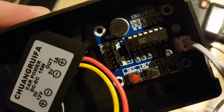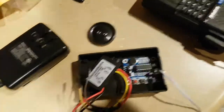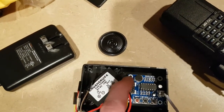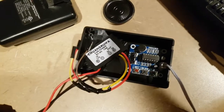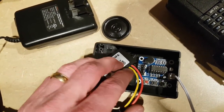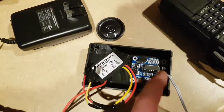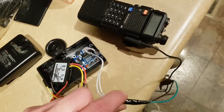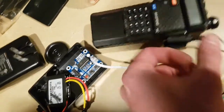How this board works: on the first pin it says VCC — that's where you apply your 5 volts power. The second pin down on the left is ground. For our purposes, all you'll need to know is the PE button, which is play edge, which means if you tap the button, it'll play whatever's recorded on the board. You can either actuate it by pressing the button or by sending positive voltage to that pin. Basically, when we run the 12 volts in, it steps it down to 5 volts, powers up the board, activates that pin, and it broadcasts out on the speaker cable.